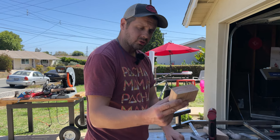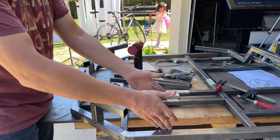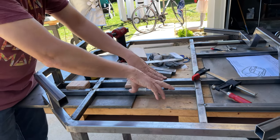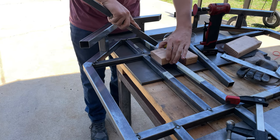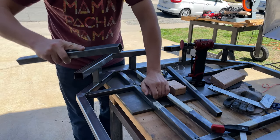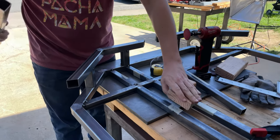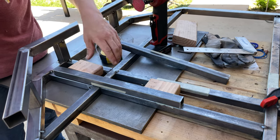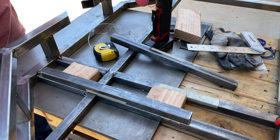This should be two and a quarter or two and three quarter inches. On the plans there's an eight and a half inch dimension. You put that in place, weld this, and get everything set. When you're trying to get the gas pedal anchors in — because they go in the same spot — I put them snug, and when they weld they kind of twist a little bit and get real tight. You can use this to find different locations, keep things straight, clamp everything down, and tack weld. It becomes a datum and reference to get your cuts butt tight and your angles very exact.